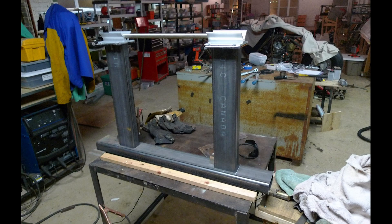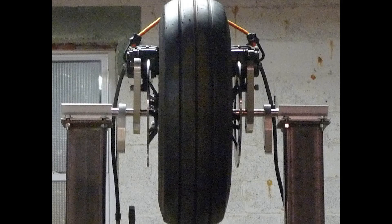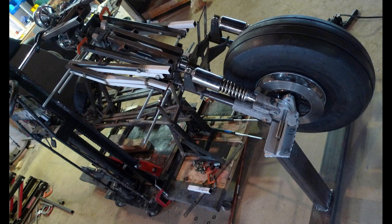Here's the first part of the alignment jig. This assembly will hold the front spindle straight and parallel with respect to the rear spindle. Here's the front end being held in that alignment assembly, where you can clearly see the leading links and the brake calipers. Lifting the bike and putting the front end on, you can now see the spindle resting in the V-blocks of the front alignment jig. The spindle is obviously extra long here so it can reach the V-blocks.